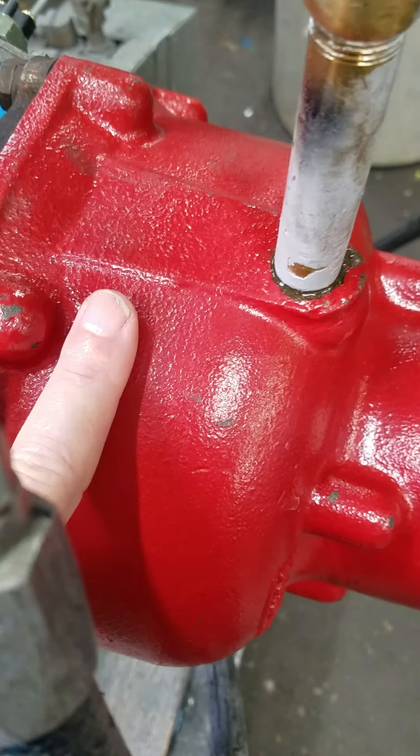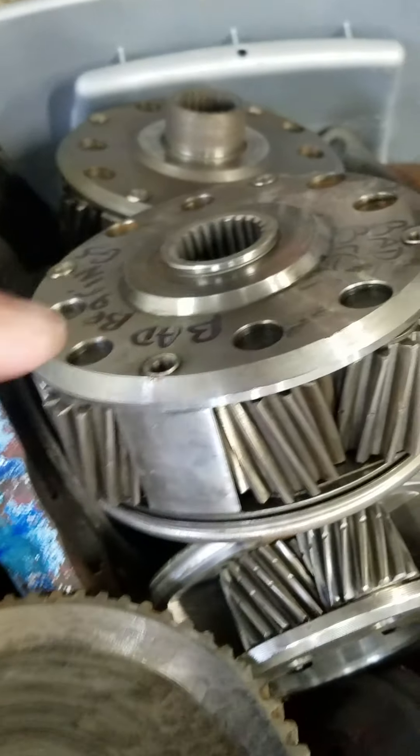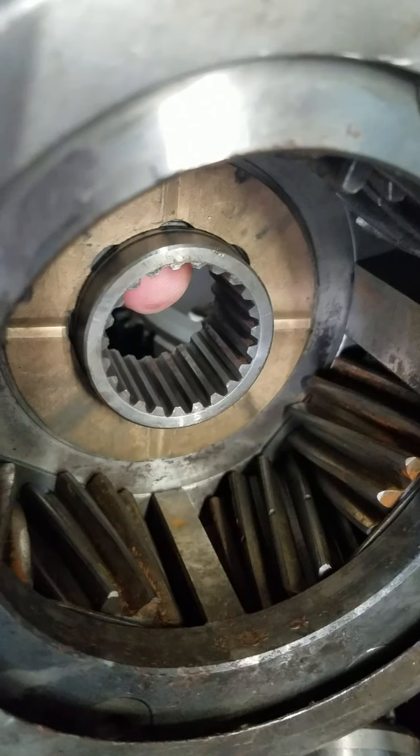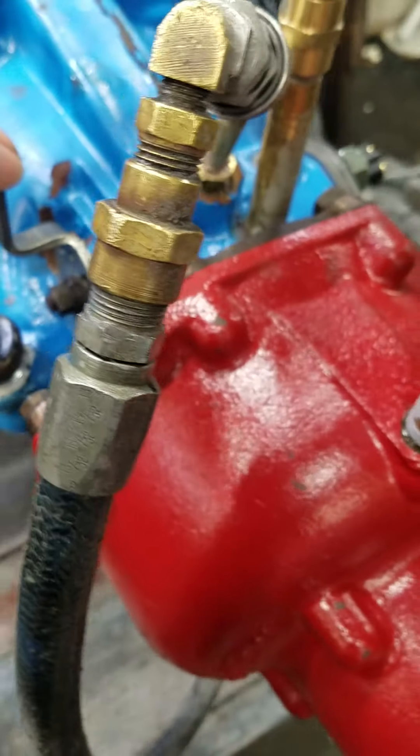Inside the planetary here, they use this planetary — as you can see, it floats. It has a thrust washer there. If it was my boat, I'd put a 1.9 to 1 and change the wheel if you could, if it's only a single application.